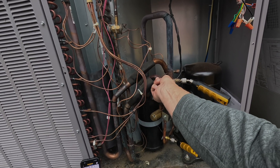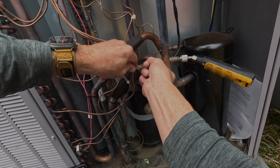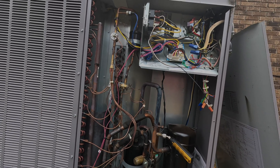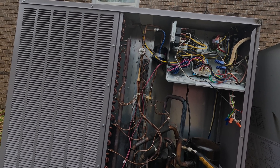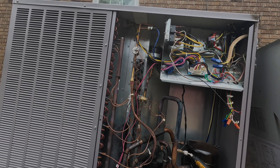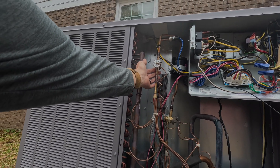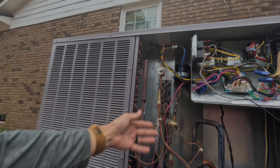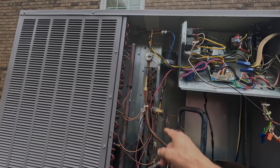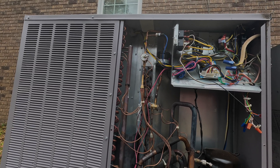I'm just checking these bolts to see if — the hose has come off with a little copper tube. My word. Normally I have some kind of symptom as to which one. When it's pumping down in heat like that, most people would assume it's this TXV, which is the one metering for heat. I don't want to assume though, because we've got two TXVs in this liquid line within a couple feet of each other.